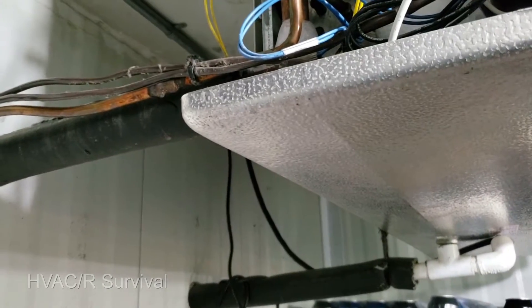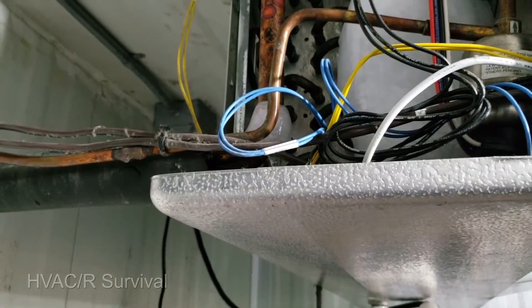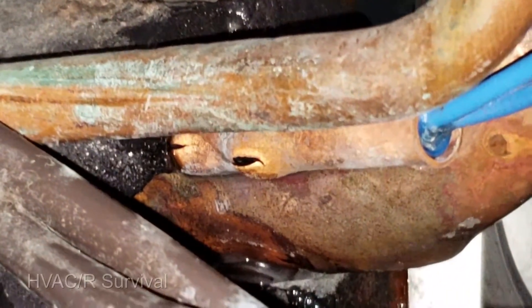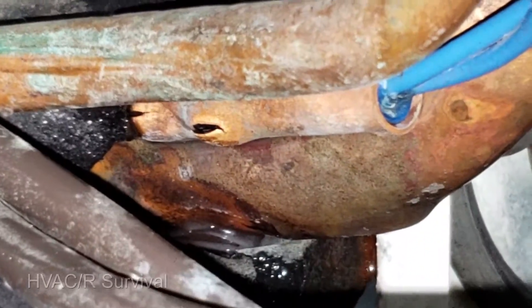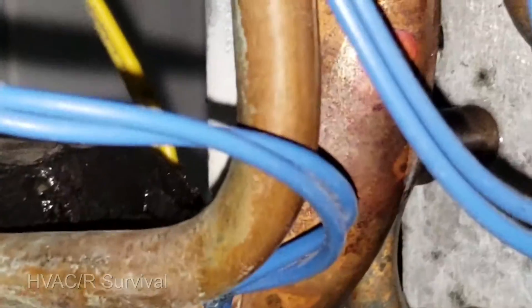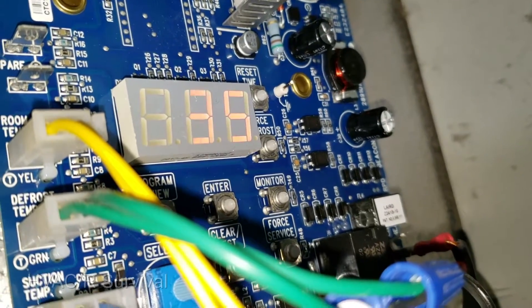So how is it going to set the superheat if it's not sensing the suction temperature? You can see on this other one — right there the white wire goes in where it should be. It's not going to set superheat correctly without sensing suction temperature. I'm going to warm it up so I can get the probe back inside. Water may have drifted into it and pushed it out. After warming it with the torch, I was able to get it in. You can see water got into it in the past and cracked the little holder, which shoved the sensor out. It probably should have had some gum or sealant in there.